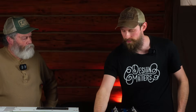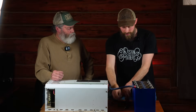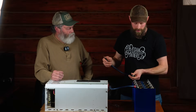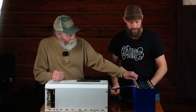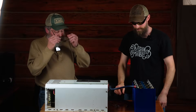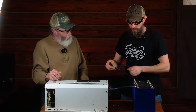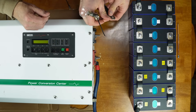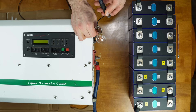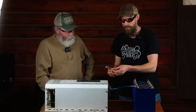You can also use a ceramic resistor, but the preferred method is a light bulb — this is a 48-volt light bulb, which should also work on 12 or 24 volt systems. Same concept: put your safety glasses on, then take your negative cable on your battery, touch the bare wire of the light bulb to it, and then touch the other end to the negative of the inverter. The light goes on and then goes out when the capacitors are charged.